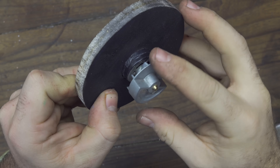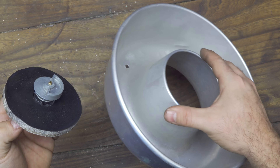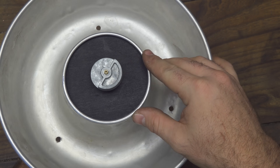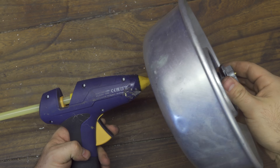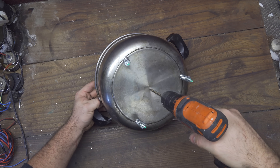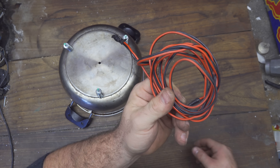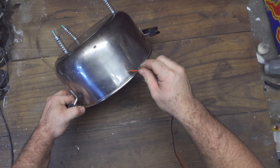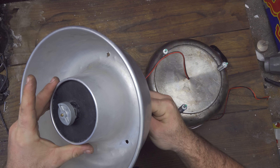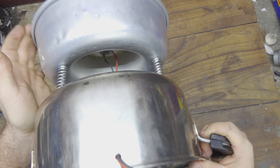You can see that once the motor starts to spin we already get a little bit of vibration — it will spin much faster, I guarantee you. I mount the parts back together and secure them with hot glue from behind. Be generous with the glue because this will shake and move a lot. I drill two more holes — one on the top and one on the side — so I can pass the cables through. This is a positive and negative lead cable, 12 volts going directly to the motor, and I solder the cables to the motor. I make sure the cables are a little bit loose so they can move freely.